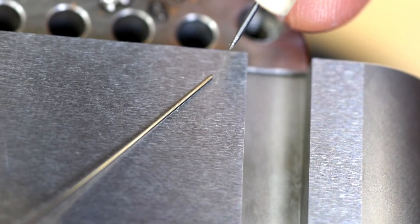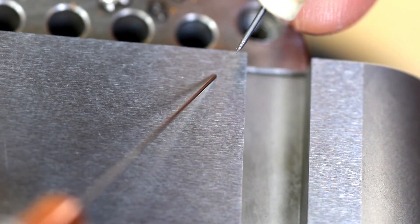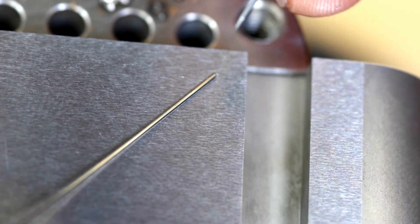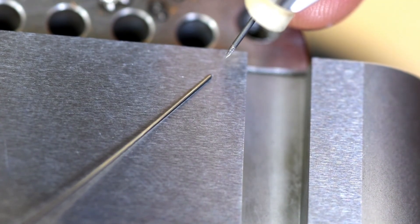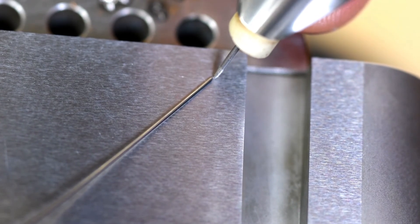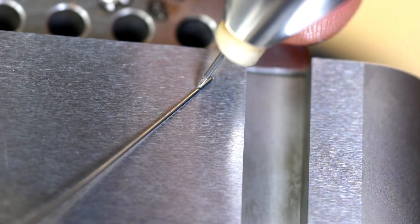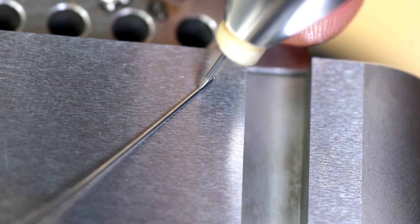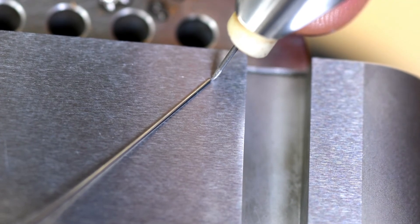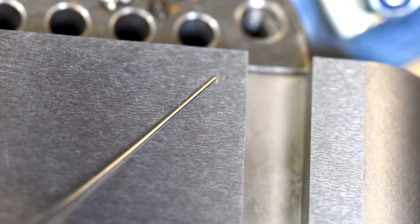When we weld with wire, it's usually best to lay the wire flat against the surface, as opposed to a point. When the wire is flat, it's going to be more connected to the base material, and we're going to get a better flow of electricity. When we introduce the electrode, we need to make sure the electrode is in front of the wire, making contact with the base material. We do not want to place the electrode directly on top of the wire — that's just going to create a ball on the wire. Rather, we want the penetration of the weld to go into the base material. Now I'm going to connect my ground and begin welding.